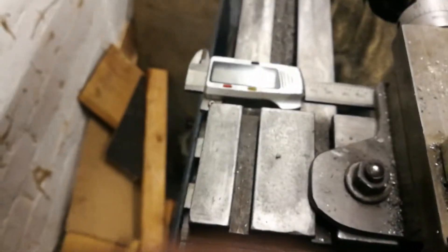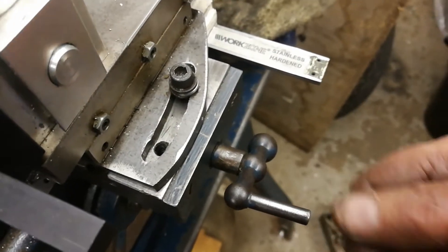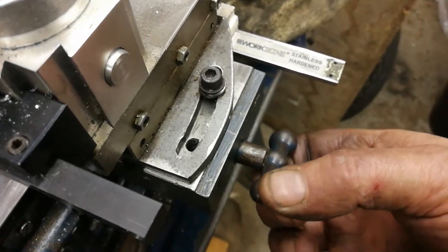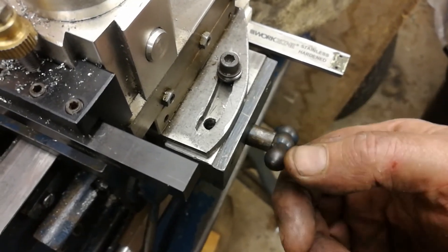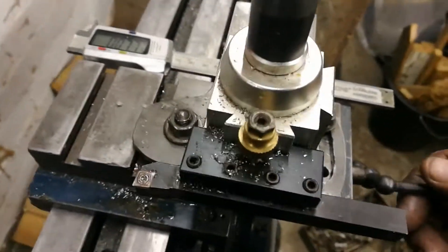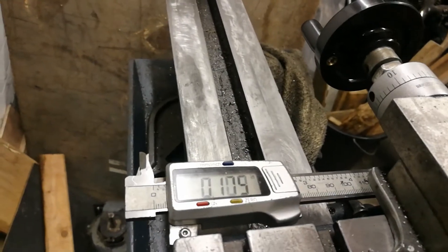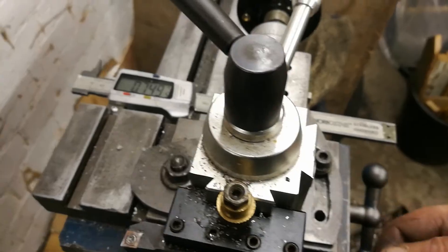Although this may seem a bit out of place on a 90-year-old machine, the micrometer lead screw will set me back about 120 quid. But even with one of those, the nut has to be good on the thread, otherwise you're working with sums in your head to take out the backlash. This cost me about eight quid from Aldi and it only measures the movement, not the backlash.